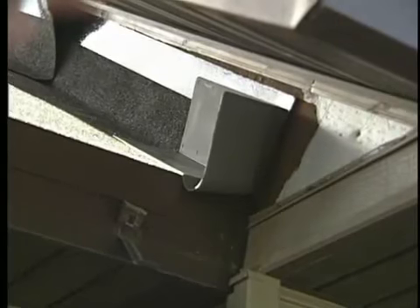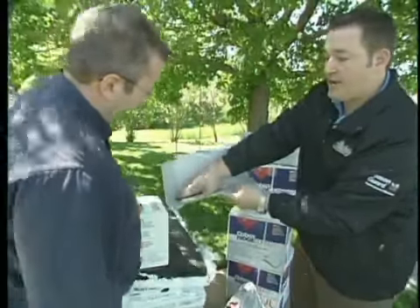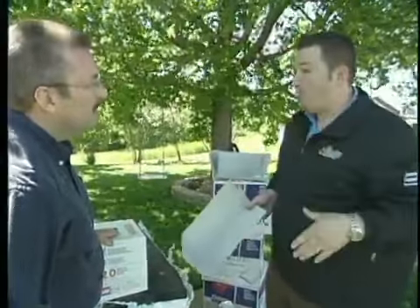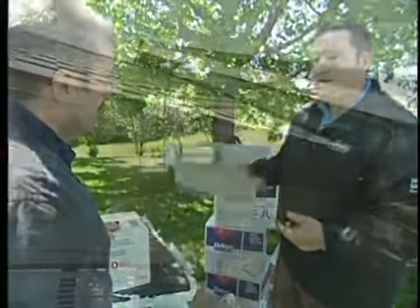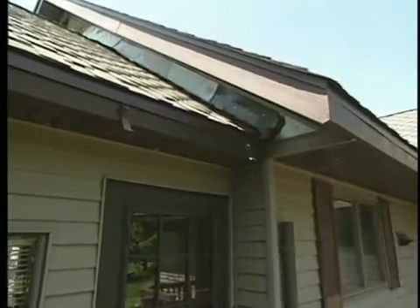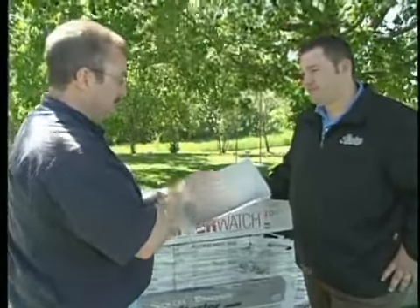What's the next step in the process? There are a lot of different flashings that go into a house. Where a roof meets the actual siding, we want that water to come down and hit what we call our kickout, which kicks it away from the house. When those roofs come into the house, that's almost always where you see the rot. I was on one house where it cost the homeowner $7,000 more because somebody didn't do a $6 part. It's not required by code, but it's required by us to make sure water doesn't get into the house. The attention to detail is what separates roofers — and these are all products that homeowners should be asking about.